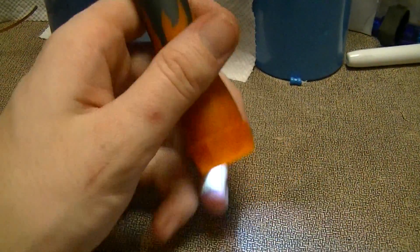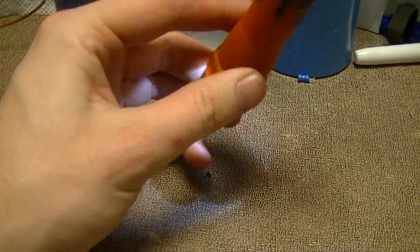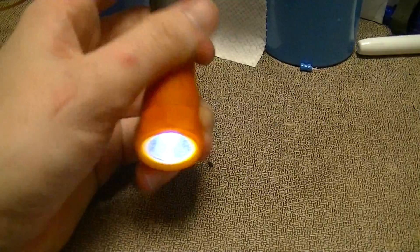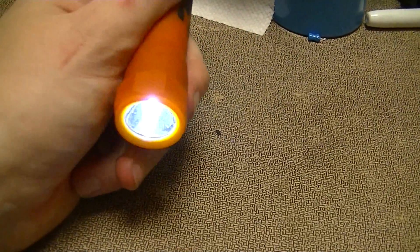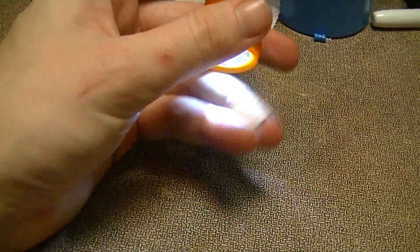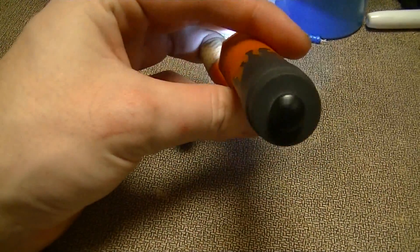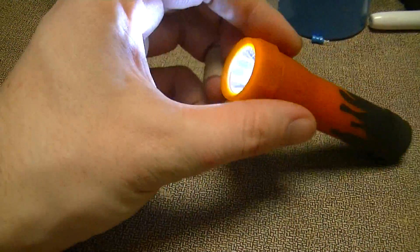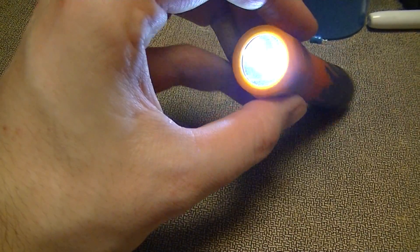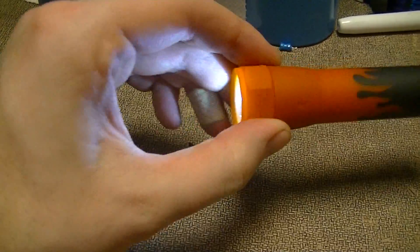So here's the light working. Not screamingly bright, but there are many times when you don't want a screamingly bright flashlight. On the plus side, this thing now has a cell life in the many hundreds of hours — they're 2.45 ampere-hour cells when new, and considering the operational current for this thing is less than 10 milliamperes, they run for weeks at a time.